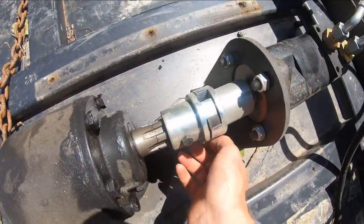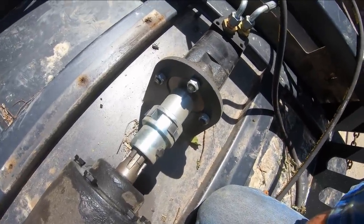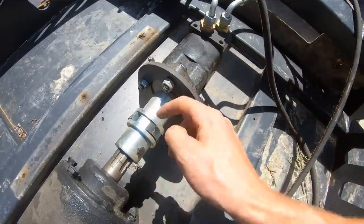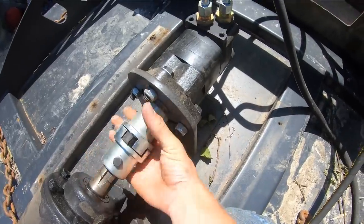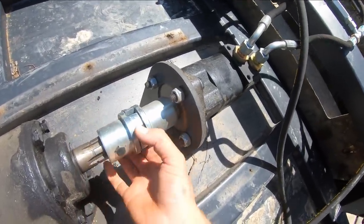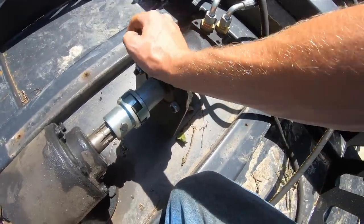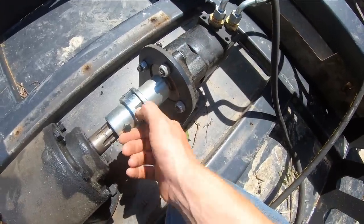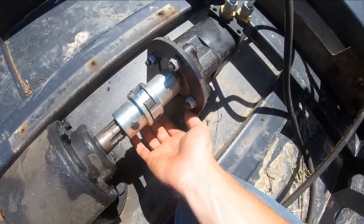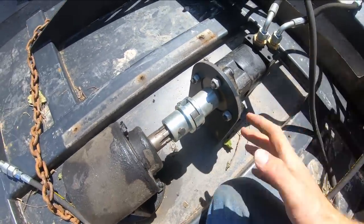The bad news continues with this brush cutter. While it's still not a big deal, it is just one of those things that's irritating because you just spent money. This thing is brand new — it literally has five minutes of run time on it. The Lovejoy-style coupler we've got here should have a rubber bushing, and you can see half of them are already gone — there's one missing there, one missing there, and I'm sure the third one's missing down below. There should be four or six of them. All you have to do to replace that is unbolt it, slide it back, take the old rubber isolator out, and put a new one in. But you shouldn't have to do that after running this thing for five minutes.